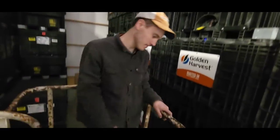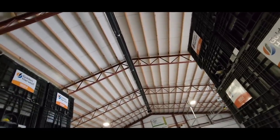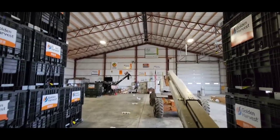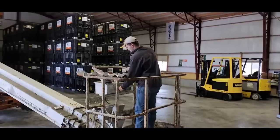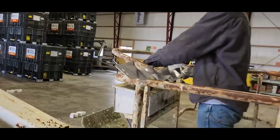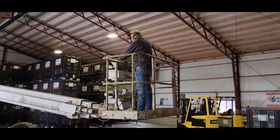This would have been tough with scaffolding. This is awesome — I've got that groove, I love the groove. Carrying all those pieces up there? All right, we've got to get that end cap on the heat shield and we need to get some side-cut pliers and trim off all our extra cable — they give you plenty of cable, we could hang that thing halfway down the roof with all the cable. One last thing we've got to do on this heater is put this baffle in. It goes in the far end vertically and just kind of helps swirl the air around to get the last little bit of heat out. Brock says he can do it. Hey Brock, don't fall out.